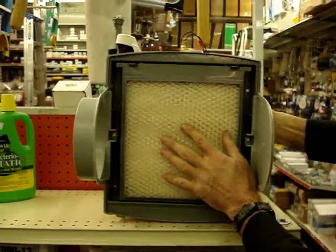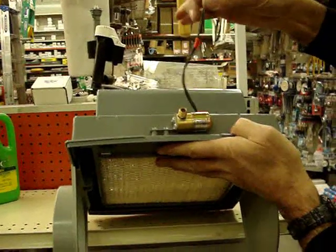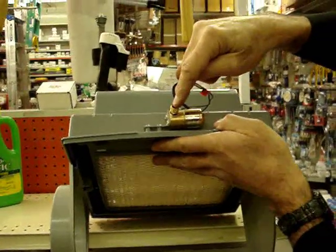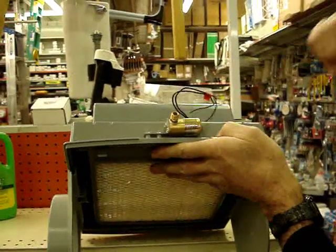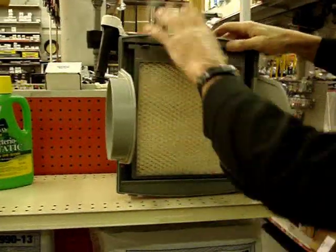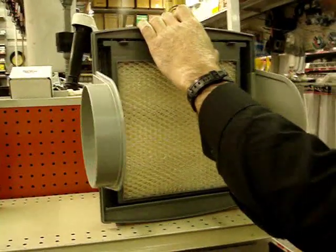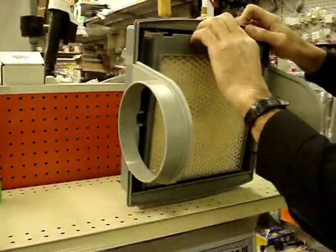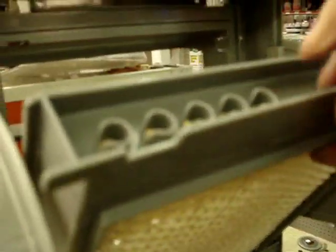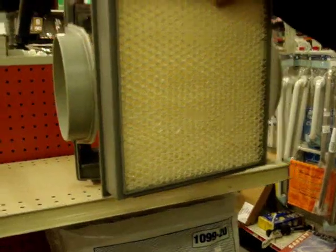What happens in this unit is it has an electric solenoid. It happens to be the same voltage as the motor on the other unit, supplied by the same size copper as the other unit, so this is a bolt-on. These units can interchange quite easily. When this solenoid activates — when the furnace is running and the humidistat calls for water — it will dump water into this tray and it will trickle through this pad as the air is blowing through the pad, hence creating humidity.